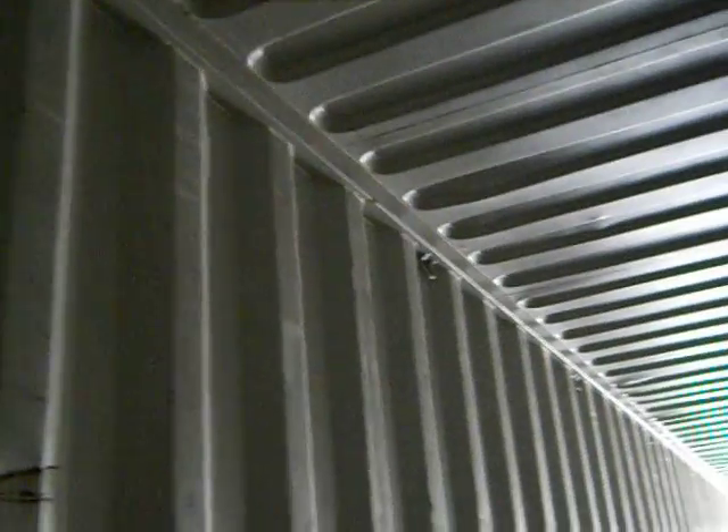As we go down here, you can see the top rails. Some containers are built without them. The top rail does not provide much strength. We can cut out about 8 to 10 feet of these corrugations and the container will still stay standing under its own strength. But if we cut out more than that, we have to run either a channel or some other stiffener down along the top to stiffen the container.